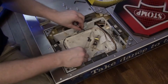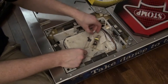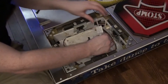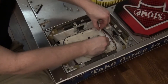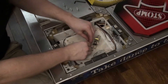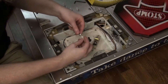But there's a bunch of stuff I have to do first. So the CCFL tube connector comes out, and the tube itself I can just sort of set aside — get rid of it, sell it, whatever. While I had this here, I took the opportunity to test all of the LEDs that I had soldered, just to make sure they all worked. And they all did.